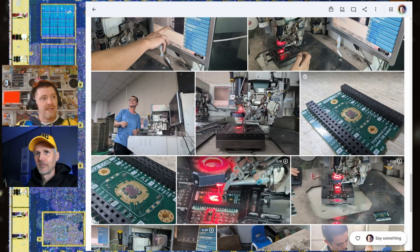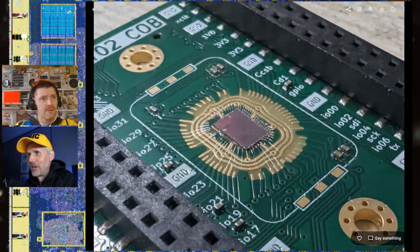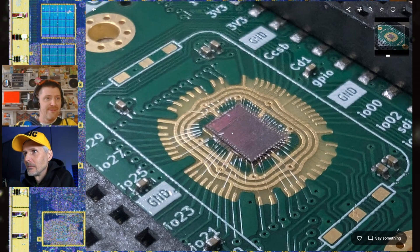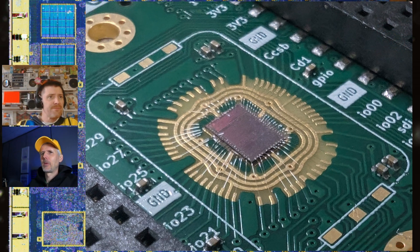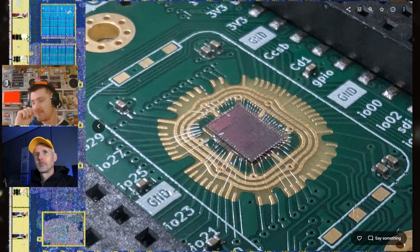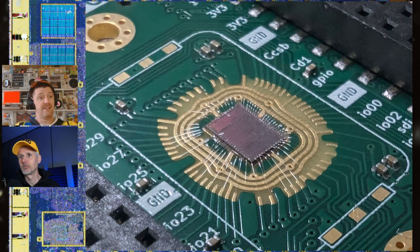Here's a picture of the finished bonding — shot on a phone camera. The wire is measured in microns and the pads are about a hundred microns wide, about a tenth of a millimeter. There are various wire sizes, and two different wire materials: aluminium and gold. Within the Tiny Tapeout team there was a lot of talk about needing to use gold, but this factory only uses aluminium. Stuart spoke to them and asked if aluminium would be suitable — they said yes, totally fine, no problem.